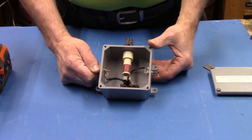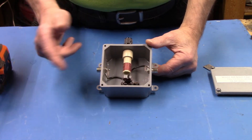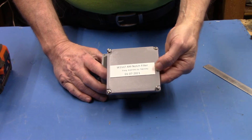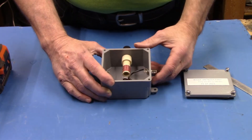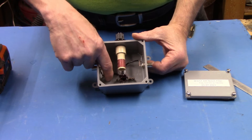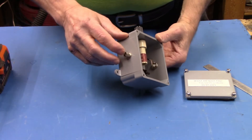With a single stage like this you can only do so much, but these are optimized values. For whatever frequency is of interest, this particular filter can get 35 dB of attenuation over 610 to 740 kilohertz. We'll show that on the network analyzer, with a shielded cable going into the LC network. The BNCs on the side could really be anything, and this is just CPVC pipe.